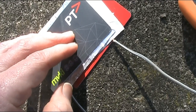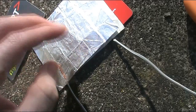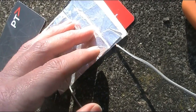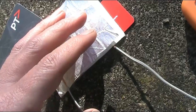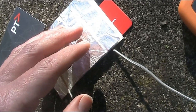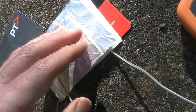The bad thing about it is it's not particularly stable. Therefore, you couldn't use it for, say, a magnetic loop antenna. However, you could use it for a very basic crystal set. Another possibility is — whereas with a radio you normally expect a variable capacitor to be stable so that the radio stays tuned to one station — you could use this as an arts project. If you put this under a carpet or rug and people walked over it, then depending on where they walked, you'd be able to change the station. You could build something like that with a crystal set, connected to a good antenna and with an audio amplifier. That would be an interesting novelty crystal set you could try.